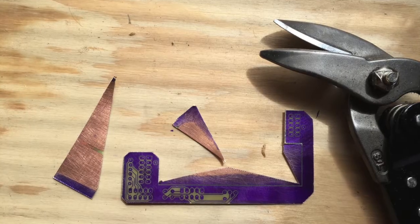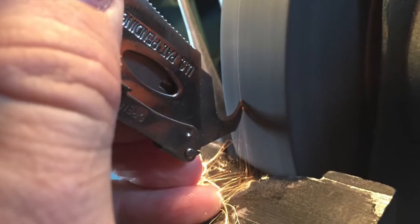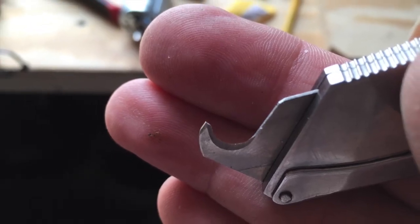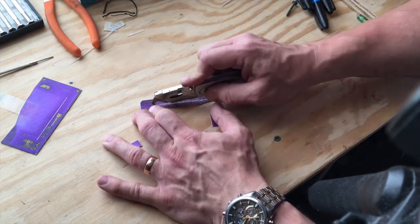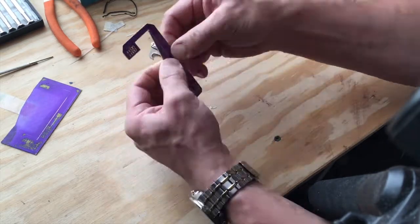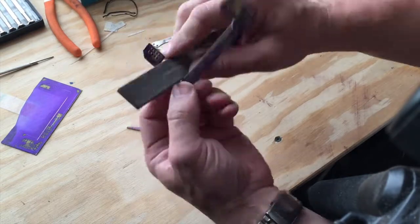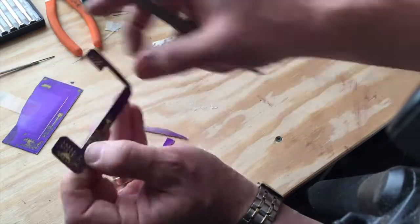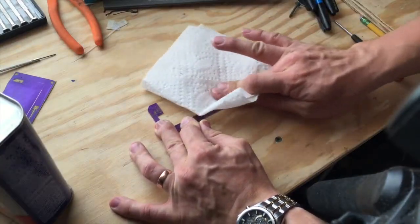What you see here is the best result I could get making the PCB at home. With a slightly modified roof cutter blade I was able to trim the shape of the board and do some cleanup work on the copper conductors. I also need to mention that when cleaning off the unexposed resist you really, really need to clean it thoroughly — I was using a steel brush.